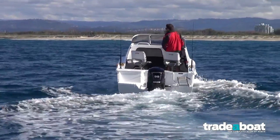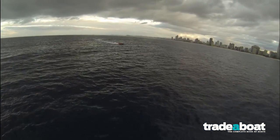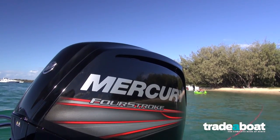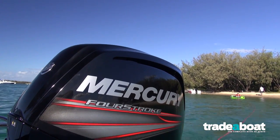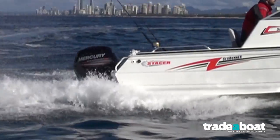However, if you're going to push heavier boats like pontoon boats, or you have a boat where you're taking out the family all the time and towing a skier, you've got the Command Thrust which is 2.38 to 1. What it does is allow the engine torque to be converted to thrust more effectively, so you can get the power down into the water to push that bigger boat and pull around those heavier loads.